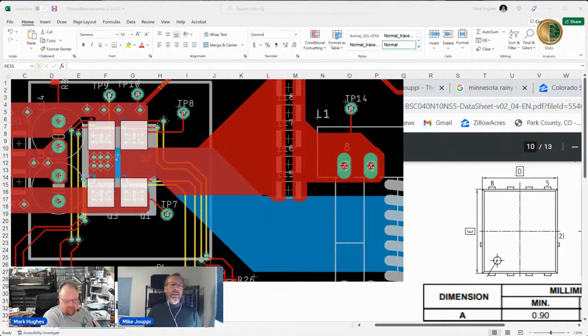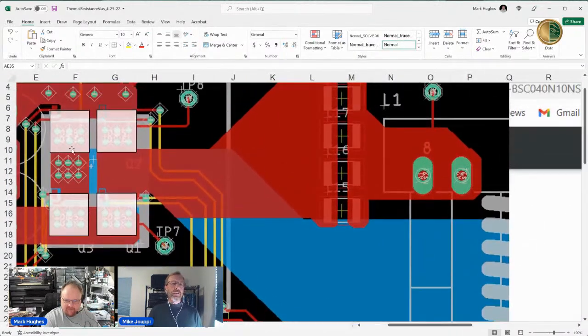Back to those white areas — I don't know if you can see underneath them, but it looks like six vias underneath each package. I think those were the thermal vias he had put in the design: six under each package and then an additional six in the middle up to the left. What I'd like to do is look at how I put together a calculation for the thermal resistance through the thermal via, and then work that problem to help Sven think about a few other items in his design.